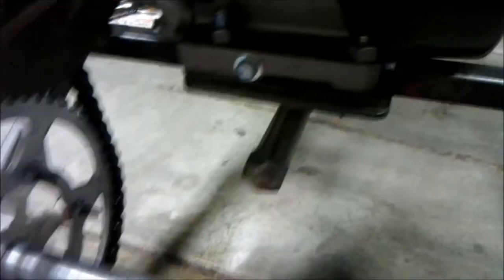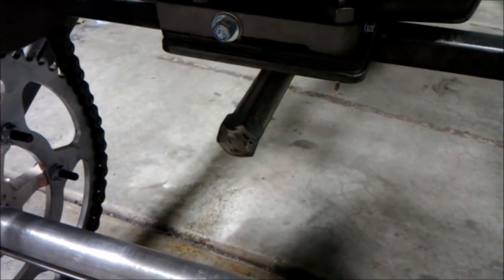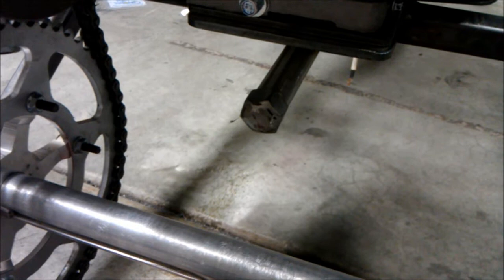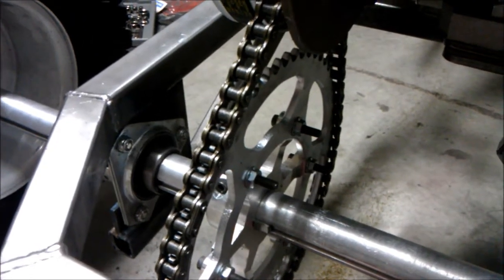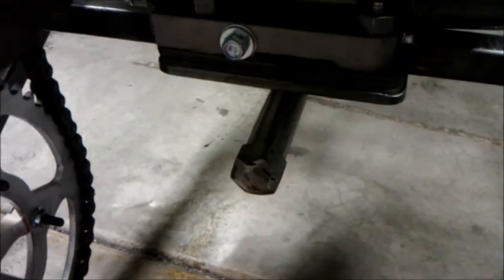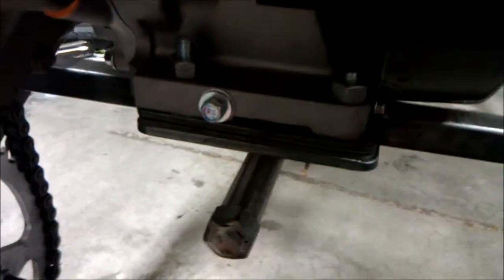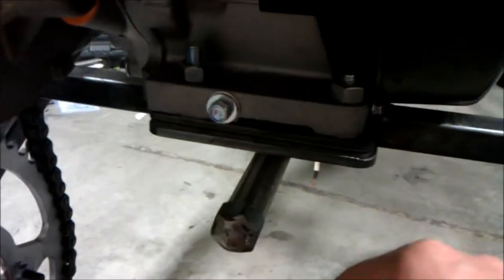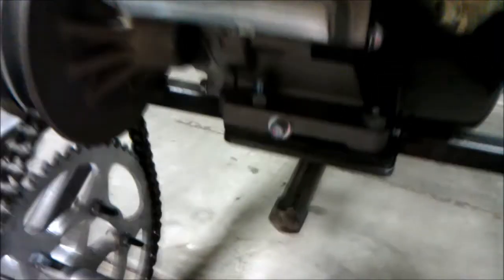Essentially, if you turn this to the left the motor will be pulled up in that direction, allowing us to tension the chain. I believe I cut two and five-eighths inch slots in that bottom motor mount, so that's the amount of adjustment I have. I figured I need about two and a half inches maximum — this is a size 40 chain, so between two links it's roughly two to two and a half inches. Right now I've got it tensioned just about right and it's sitting almost all the way back. As the chain stretches, I'll loosen the mounting bolts and rotate this to the left to tighten it back up.